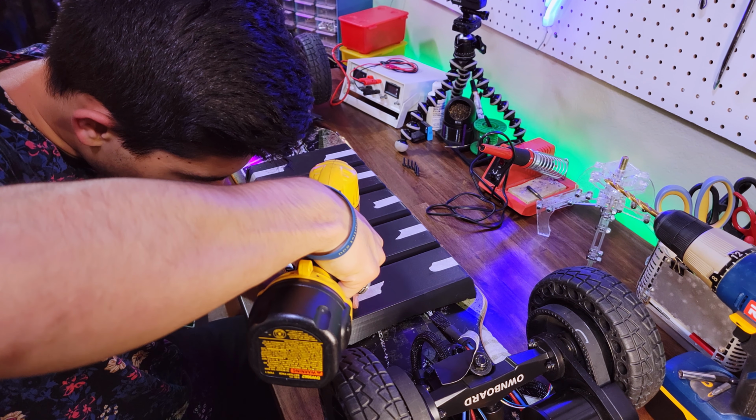Now, your mileage may vary on whether the wood around the insert will split. Sometimes that can happen. Don't worry about it too much. But if it looks like it's really falling out, then you might want to consider drilling your hole out a little bit bigger or just loosening up a little bit. But since I've got epoxy in there, I don't really have to worry about it too much, and it doesn't look like it split very much at all either. So there's one installed, and now I gotta do 17 more. So I'm gonna get on that, and you guys can watch a quick time lapse.